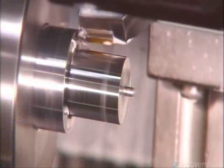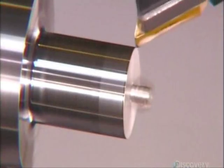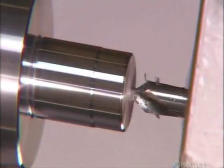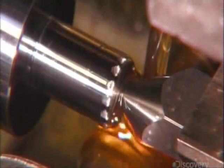At the manufacturing plant, they machine the rotor from a bar of steel mounted on a lathe. It takes about a minute and a half for the computer-guided precision tools to carve out the basic shape. The next machine carves teeth on one end of the rotor, creating what's called a hobbed edge.